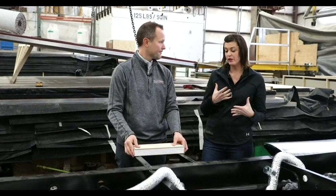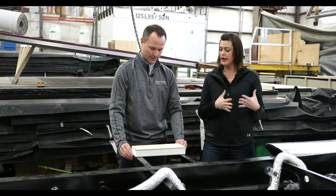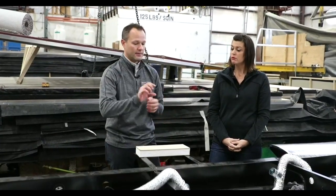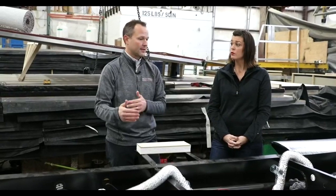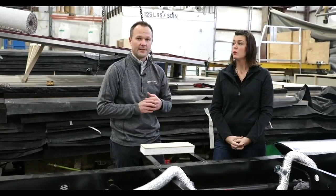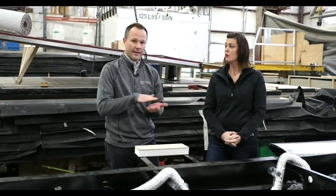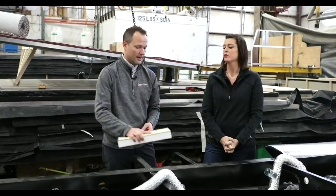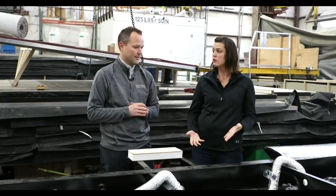So that's some of the Reflection line. What about the rest of it? The 303 and larger will have a 2x3 aluminum stud, 16 on center, with 5/8 decking — one-piece decking on top of that — and then in between you'll have the Darco underbelly and batten insulation for the insulation as well.